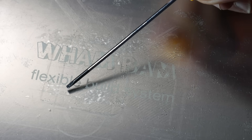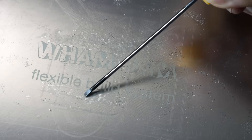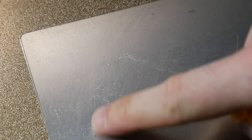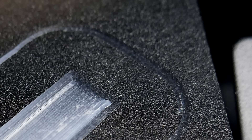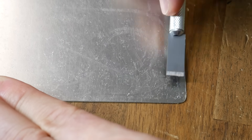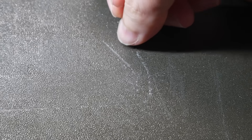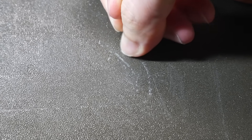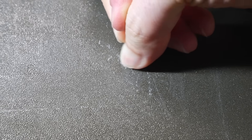Compare this to a PEI sheet — or in this case, the PEX variant. The cross-hatching you can see here is from a print started with the nozzle far too close to the bed, effectively engraving the pattern into the surface. Yes, you can feel it with your finger, but the print surface is still completely usable. You might notice tiny bubbles form under the PEI in time, but they're inconsequential and don't affect it at all. With a BuildTac surface, smeared filament from a first layer too close is probably stuck there forever. Whereas with a smooth PEI sheet, I have no problem taking a flat blade to clean off any filament. With a textured surface, you can use your fingernail or a hard piece of plastic to scrape off filament built up in the crevices.